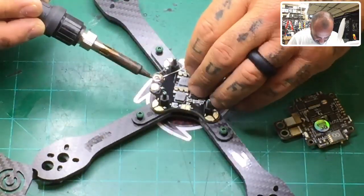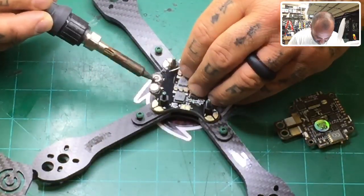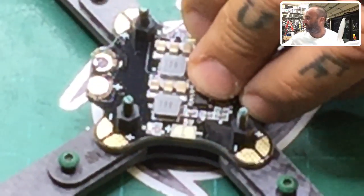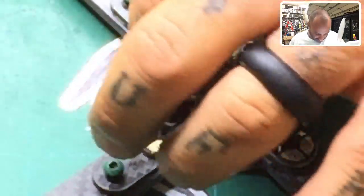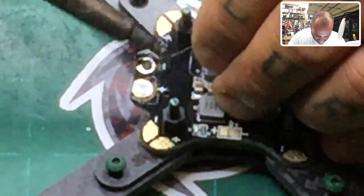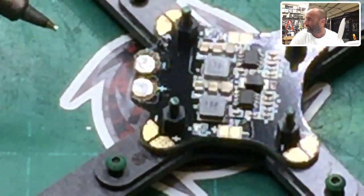So what you'll do is when you get your solder down here, just run the soldering iron around, and you see how that gets solder on the edge there? Let's see if I can zoom in on that. Okay, so it's kind of blurry, I guess. But yeah, you can see that it's through, right? It's not closed yet. So as you're spinning it around, quickly cross over the center with it, right? And you'll slowly close that gap and go in a circle, and there you go. Now it's sealed off, okay?